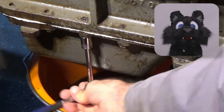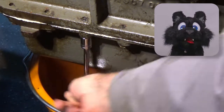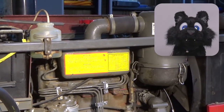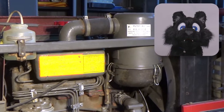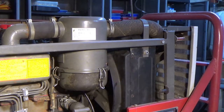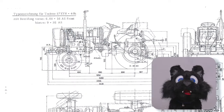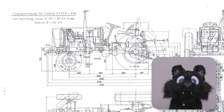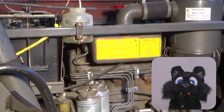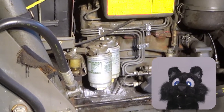This is where I found out that the oil pan is in fact part of the front axle mount. In order to remove it, according to the service manual, you have to jack up the tractor in the middle, split the front, and remove the radiator section with the axle in one piece. Another decision was made: I am alone and I don't have the tools or the space to safely remove one-fifth of a tractor at once. So I shall disassemble the engine bit by bit until I can remove the axle and oil pan.